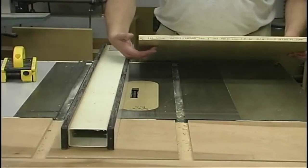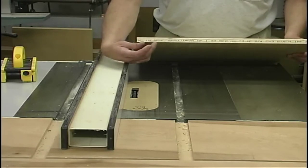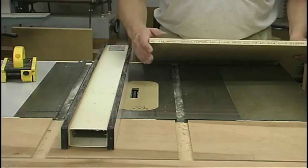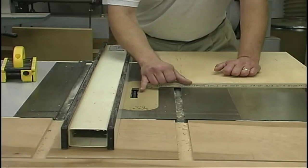On the bottom surface of our 2 large bottom drawers, we need to have a 1/8 inch deep by 1 inch wide groove machined in them, and that will receive the board that's going to hold the bearing mount. Now to machine those, I'm using my stacked dado head cutter, which is only set up at 3/4 inch wide. It is raised up at 1/8 inch.